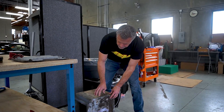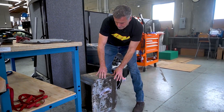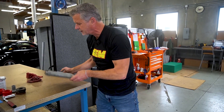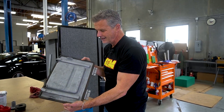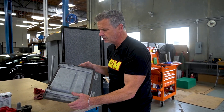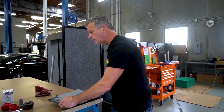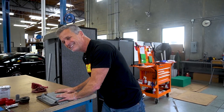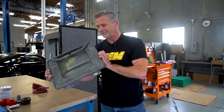One of the challenges is maintaining this look while creating a super clean environment for all the components and protecting them from the weather. These sections — I've added some paint remover, epoxy paint remover — and then we're going to sandblast it. A good example of what the finished product is going to look like is the door for it — still looks worked, old. This is going to be rubberized, primed, and sealed, with white paint so it's brighter inside these boxes — or we'll add LED lighting inside. The outside still looks old school.